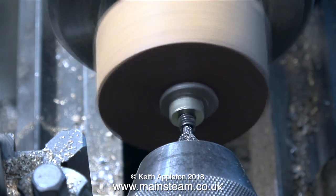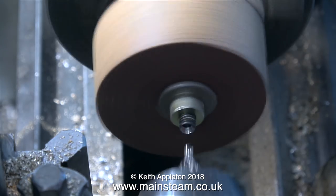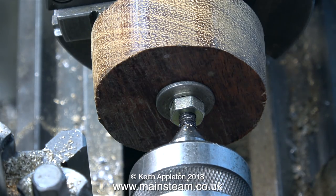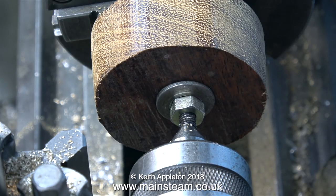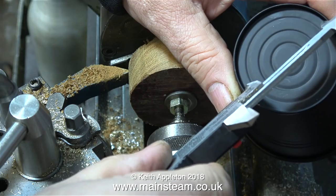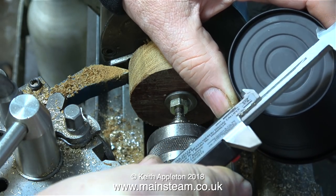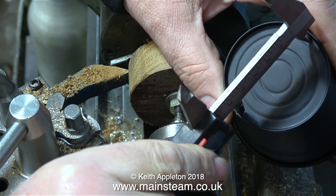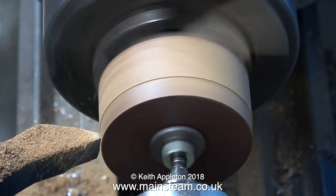At this point, before Inspector Meticulous and all his contemporaries write in to tell me off — yes, I know it's not 100%, but it doesn't need to be. This is not a part for a satellite, or a gas turbine, or a rocket. It's just a simple drilling jig for drilling holes in the bottom of metal plant pots, which are going to be used to make the lampshades for these lamps that my friend makes. Here's the live centre going into position, so all I need to do now is rotate the work and use a lathe tool to cut it to the right size. I do need to know what the finish diameter of the mahogany needs to be, and for this I'm using a set of calipers.